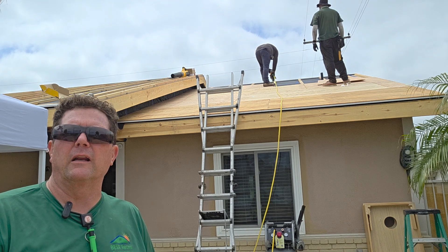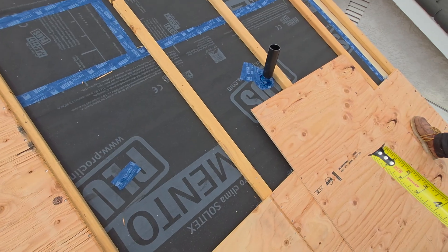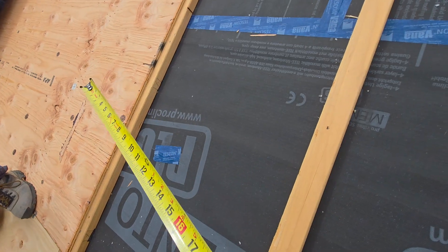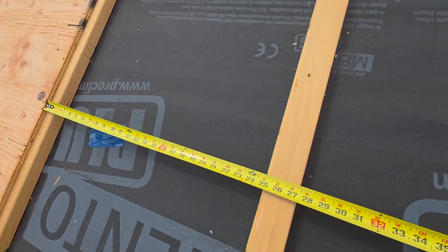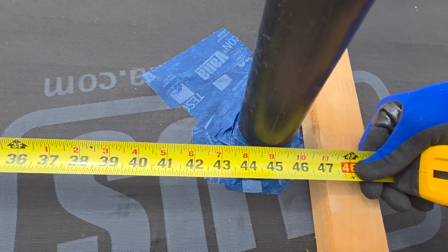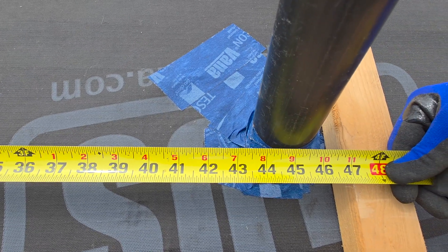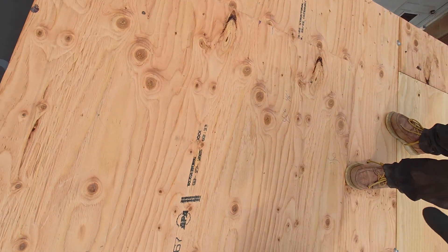I'm going to make sure they're doing it right — get up there and make sure the measurements are correct. I want to make it dimension so we've got our mark over here already for the side of our pipe, then I've got to come over this way and measure to it. I've got 43 and 5/8 — write that down, Patrick — 43-5/8 and 46 and an eighth. Those should be my marks for my hole.